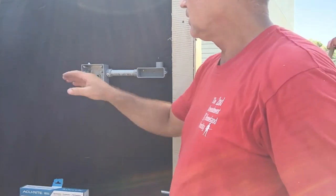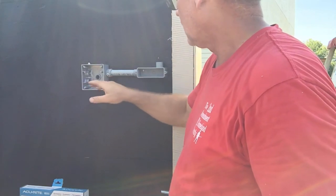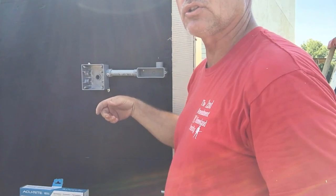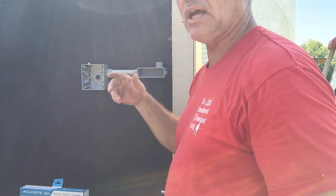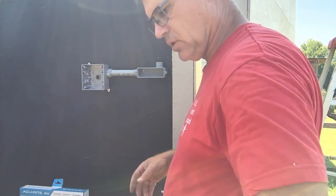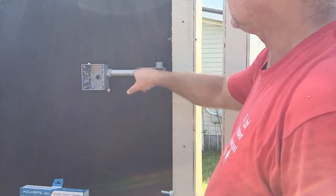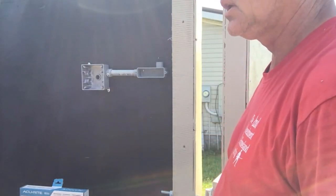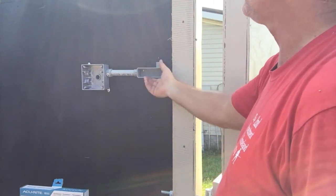So just half of this will be an electrical outlet. I went to 3/4 inch size because I need to pull 2 wires through there, 1 to each set of fans, and then there'll be 2 switches on the outside to where I can turn either or all of them off. At the store I was trying to get the corner pieces, but they were out on the 3/4 inch size, and I opted for these boxes. It makes it easier for pulling wires anyway.